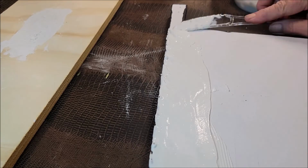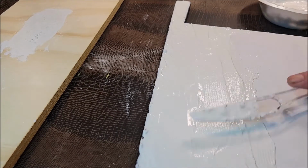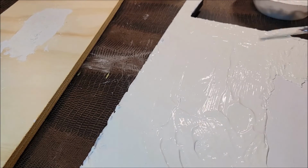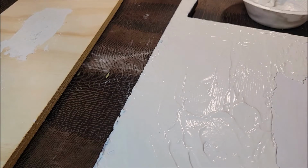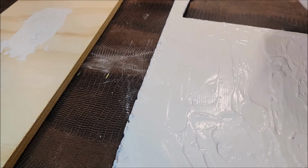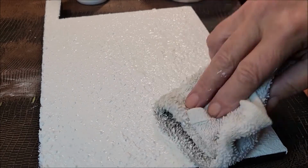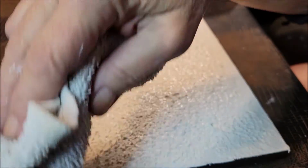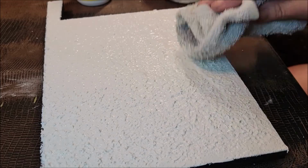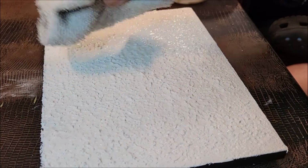An uneven layer of this mixture was spread on the 2 brick walls. This was about a 32nd of an inch, or about 1 millimeter thick. The real walls are slump block, which are rough concrete blocks, 4 inches by 16 inches. I'll show you a close-up of the real wall shortly. About a half an hour after laying the mixture down, Sal texturized the surface with a ruffled shop cloth to create some brick-like texture in the spackle mix.